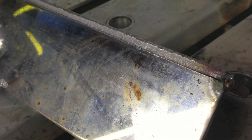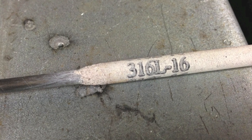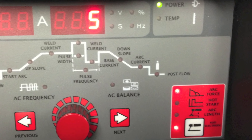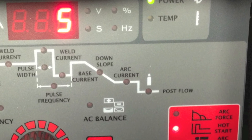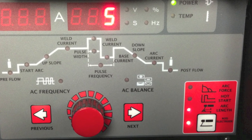You can see that even if stainless steel comes in contact with carbon steel it will still rust. The electrode is 1/8-inch in diameter. The amperage was set at 100 amps DC. The arc force was set midway at 5, the hot start was also set at 5, and as a good starting point I set the arc length at 5 as well.